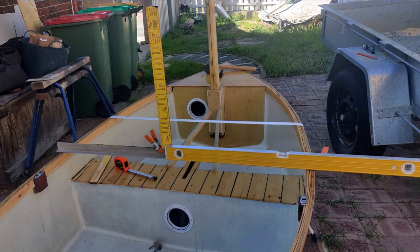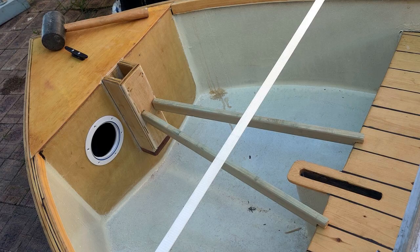So I re-plumbed the mast step using spirit levels, glued it back onto the front bulkhead, and then wrapped some fibreglass around it — I think it's probably pretty impregnable now. As I said earlier in the video series, I tend to just put things together and see if they break rather than over-engineer and find myself wondering if I've used too much. So that was failure number one.